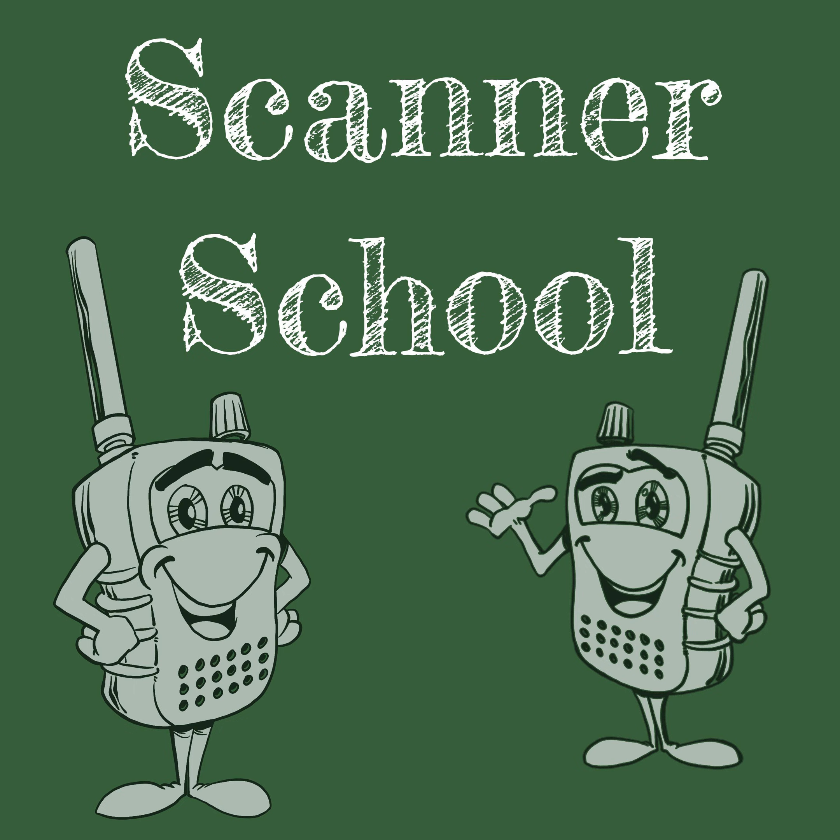Let's take a look at the current two flagship models that Whistler has — the TRX-1 and TRX-2. These have V-Scanner 2 in them. A V-Scanner 2 will save your changes on the fly. Instead of having to go into the V-Scanner menu and click Save, as you make changes to the scanner's configuration when a V-Scanner is loaded, the scanner will save it to that V-Scanner automatically. If you want to create a V-Scanner from within the radio, it's much easier to do it within the EasyScan software.